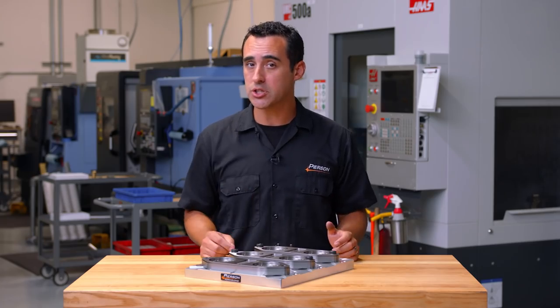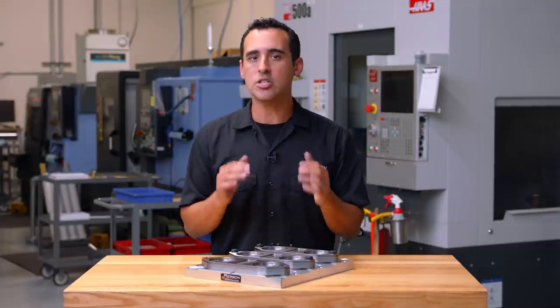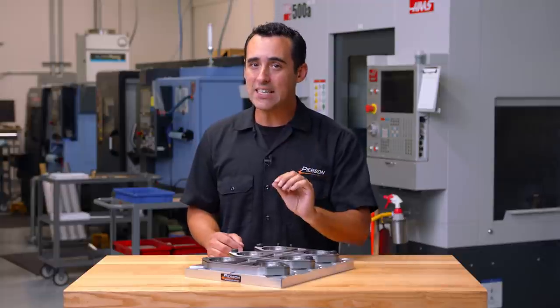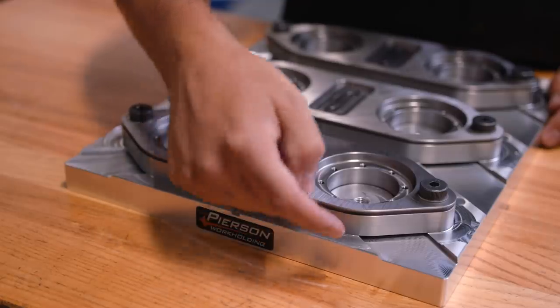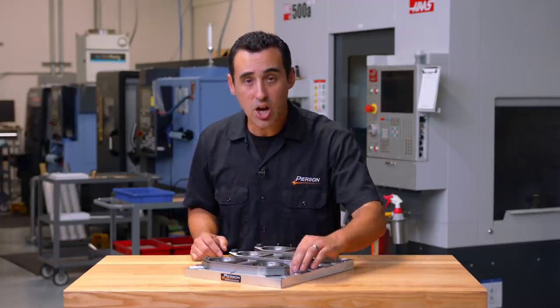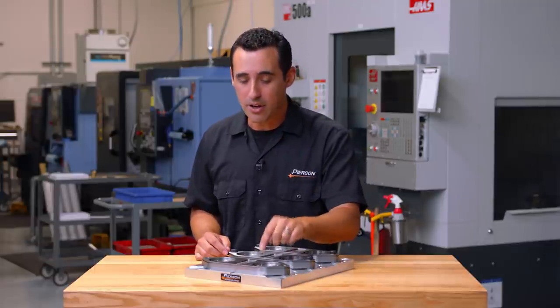Because all the critical dimensions were done on the bottom side already, the tolerance for most of these top-side features is plus or minus three thousandths. Since the only critical Z dimension is the distance from the bottom of the part to the top of this bore, we've set our Z zero plane as the top of the pallet, not the top of the part. If you're machining different sized parts on an oversized pallet, you have to consider that you may get chatter if you go too far out or too thin on the pallets — I've made a video specifically about this topic and I'll add a card and a link to it in the description.